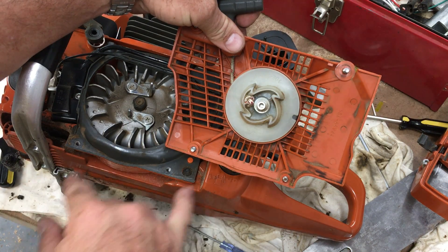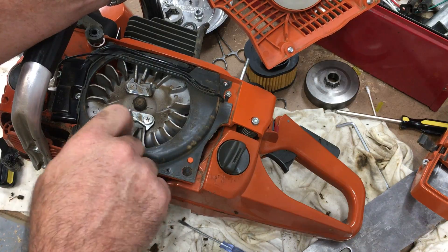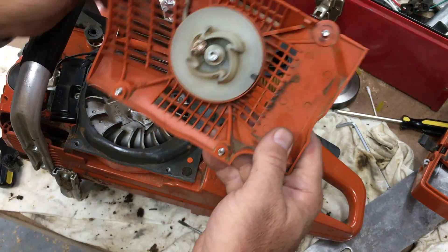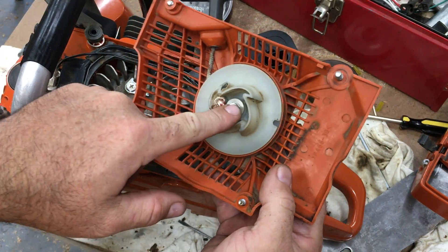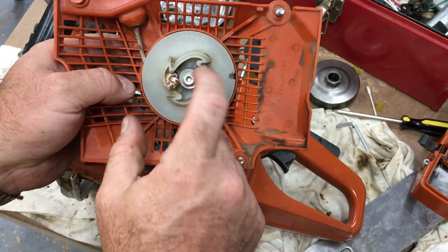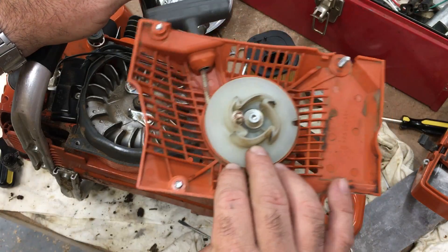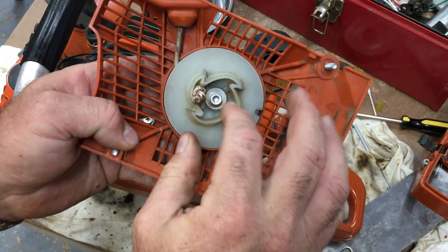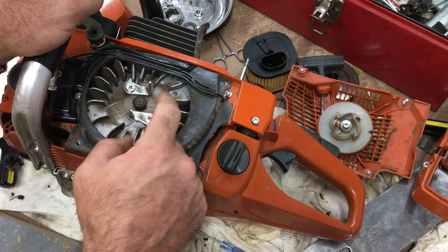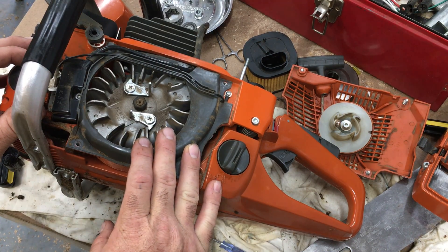This design reminds me a lot of Echo. They have metal pawls on the flywheel here, and there are actually four catch locations for those pawls. The spring seems pretty sturdy. One gentleman posted a comment on Facebook saying his plastic post where the screw attaches broke — his short-term solution was to drill through and use a machine screw, then he replaced it with an actual Husqvarna piece. But it feels fine to me, and that post breaking would probably be the only way it would fail. The springs seem to have a decent amount of tension to keep the pawls in the correct location, so I don't really foresee a problem.